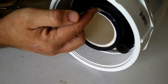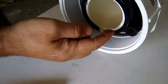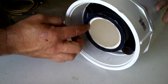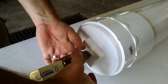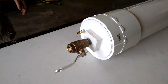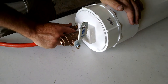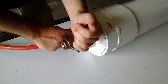Apply a little smear of grease on that O-ring — almost all pneumatics have O-rings designed to seal, and the O-ring only seals if it's lubricated. Insert the disc and thread in the back assembly. We're going to make it hand tight for the moment. I have the compressor set for 75 PSI. Close the ball valve, take the air chuck, snap it on, and once it's snapped on you're going to hear air transfer into the barrel assembly. Once it quits transferring, trigger it by opening the valve and that will fire the device.